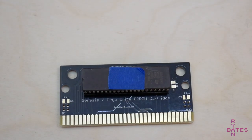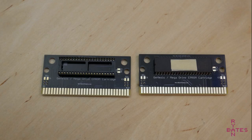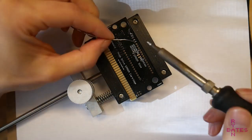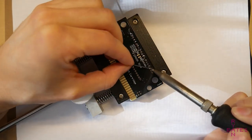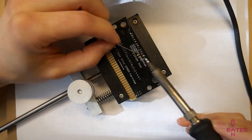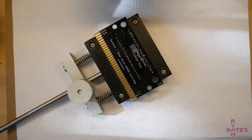With a tester PCB, you can insert your EPROM, don't solder it, that's what the socket's for, and make sure the game boots. After that, you can solder the EPROM into an actual PCB. And that could be one that you've made from a PCB fabrication, or one that you are using as a donor from a lesser appreciated game.